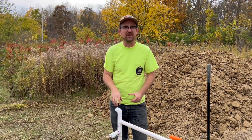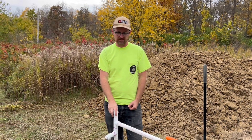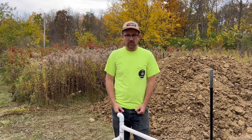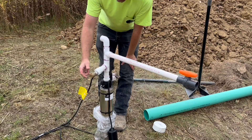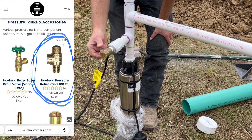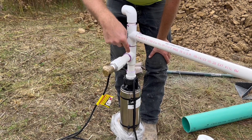It's just going to build up against the pump and create problems with the pump itself. So what we do in this case is a couple things. One, we put in a half-inch pressure relief valve right here — this is just teed off of the supply line coming out of the pump.